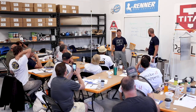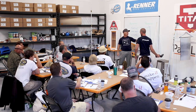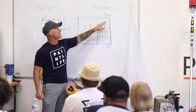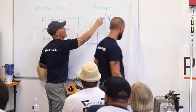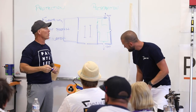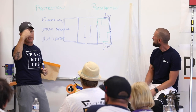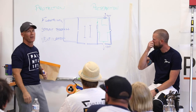Ventilation is extremely critical if you're going to be dealing with lacquers — though now we're going to be eliminating those in favor of water-based coatings. This is actually a key point: with John sitting in here spraying in this booth, we use a box fan sitting in that doorway blowing out, so everything John's spraying gets sucked out of the spray booth.